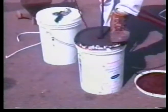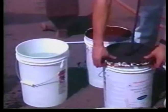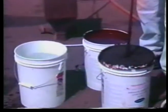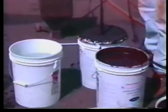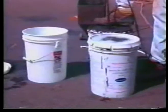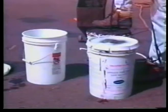Since TA-500 is reusable, we recommend that you mix all buckets at once. This can be done for the whole day by one person while loops are being marked and cut, or at the shop before the crew goes into the field. Do not overmix TA-500. To do so can induce air bubbles into the sealant.